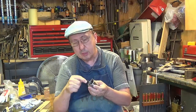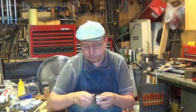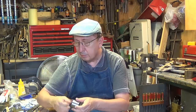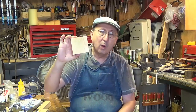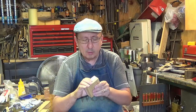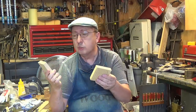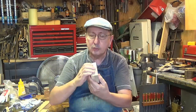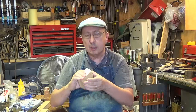The insert includes three screws but I don't think I'm going to be able to use them, so I'm going to remove those. I'm going to start with some small pieces of wood — these little blocks are three and a quarter by three and a quarter, which is about 83 millimeters or 8.3 centimeters. These are yellow pine and I'm going to glue them together with the grain going in opposite directions, one going up and down and one going side to side, and use that as my first layer.